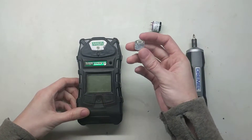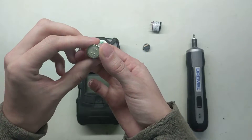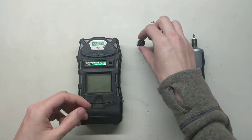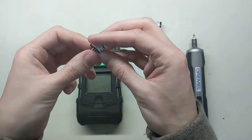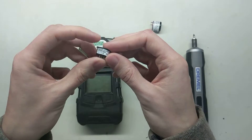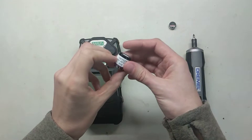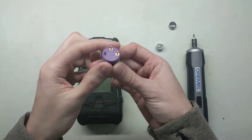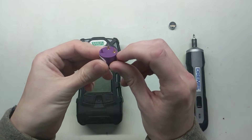So this is going to be your LEL sensor right here. It's the metal one, explosion-proof housing. It's your CO/H2S — so if either one's having a problem, your CO or your H2S, this is the one to replace. Then here's your oxygen sensor. It's the big purple one. Three prongs to the bottom. The thing you want to check on any oxygen sensor — just make sure on the pins there isn't any corrosion or anything along those lines.